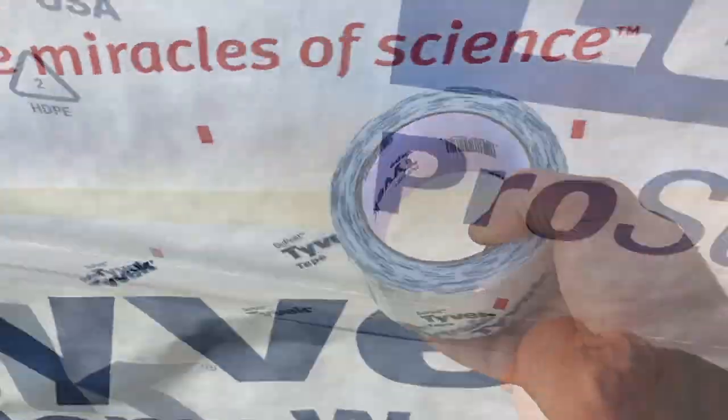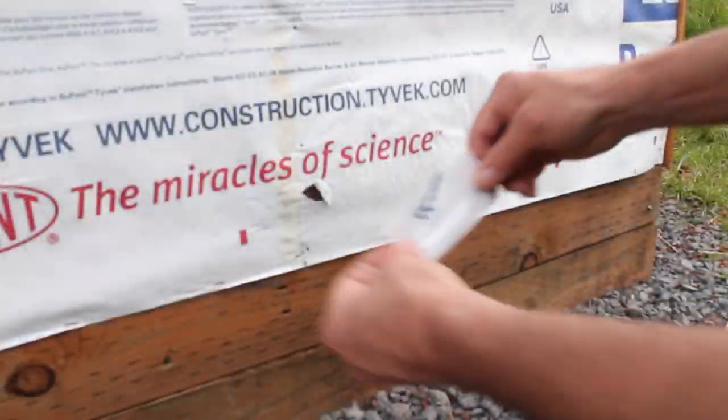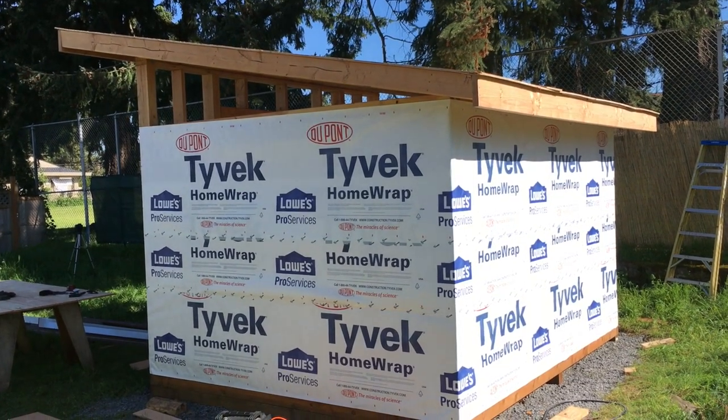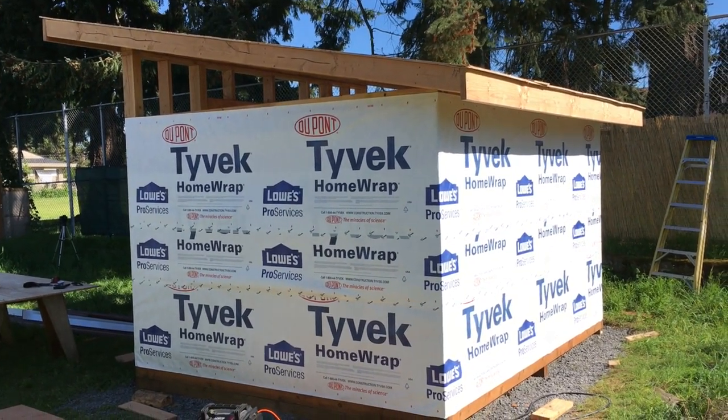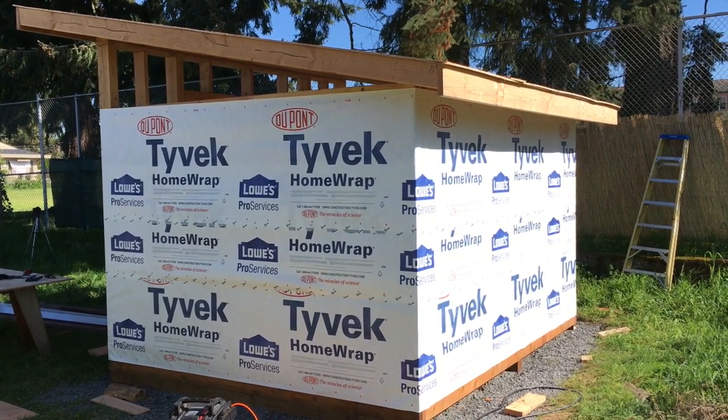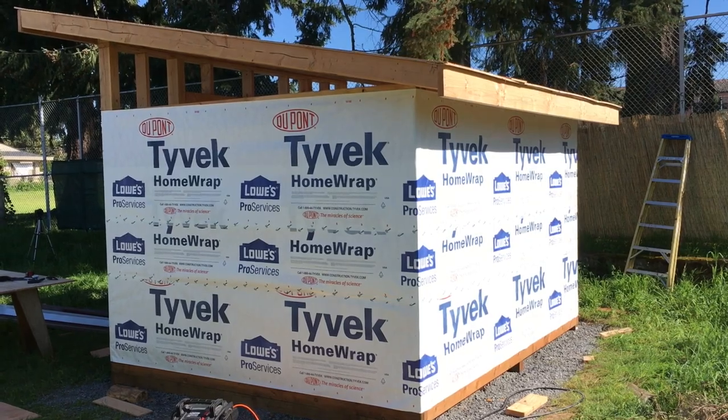This Tyvek is a moisture barrier that prevents water from entering the wall cavity from outside, but allows it to escape, kind of like a Gore-Tex jacket. Oh, and by the way, Eric wants to leave the front of the teahouse open until winter, so for now, I'm only enclosing three walls.